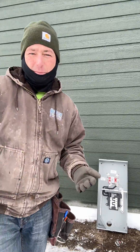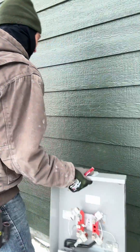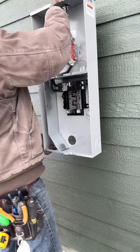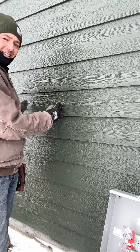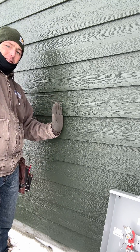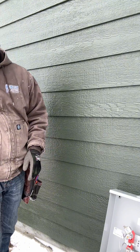As a general rule, I like to always hit a stud on one side of these holes — just makes me feel better as a human to know that it's properly installed. I measured off of that, went 16 inches, knowing that's going to be the center of the stud, so now I've got a line I can use to mount my meter.